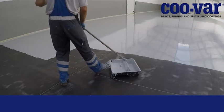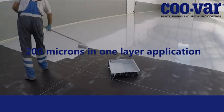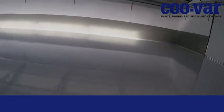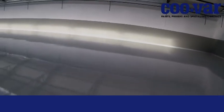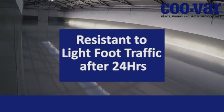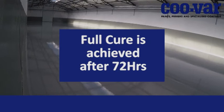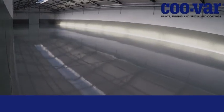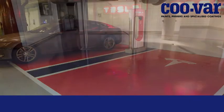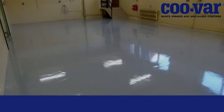Correct spreading guarantees wear resistance and opacity. ProFloor Plus is a solvent-free resin that provides a coating thickness of 200 microns with one application. Drying time and use are governed by temperature. At a typical object temperature of 20°C the coating is resistant to light foot traffic after 24 hours. Full cure is achieved after 72 hours, whereby the coating is resistant to chemical and mechanical wear. ProFloor Plus works well in warehouses with forklift traffic as well as garages, car parks, workshops and showrooms.